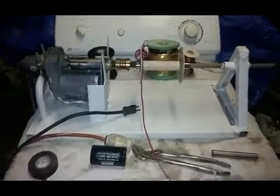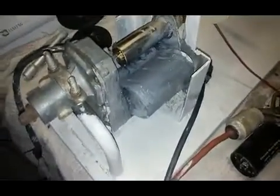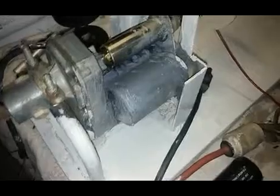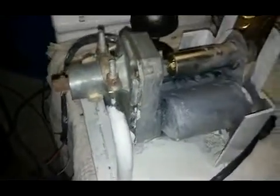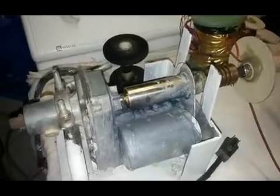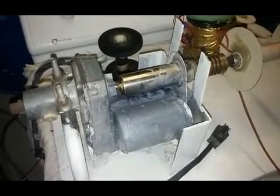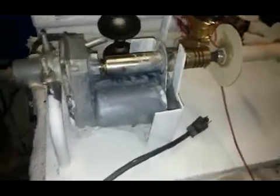I got to kind of stand back just for you to see it. You'll see this motor here. This motor is out of a chair, but you're going to have to pull this out and put a regular oil cap in this, because it's always in start mode and it won't last longer than five minutes before it overloads — but it does run indefinitely. It's got a gearbox right there. You can find these a dime a dozen out of those upholstered chairs for the living room where the feet go up and down. Any of your appliance stores throw them out regularly.